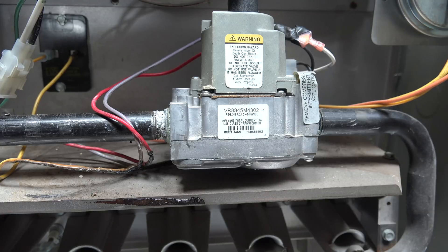No doubt about it. So what is the lesson of this? Do not replace a rollout switch with a jumper. It went out for a reason, and you could cause a fire in the structure. So that's pretty much it on that one.